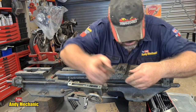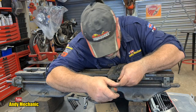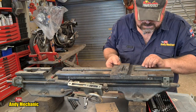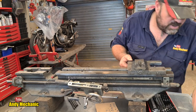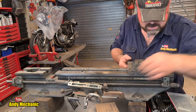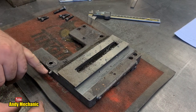All the locknuts are loose. Let's see if we can get these undone now. That's one, only got to back him off a little bit. Two, three, four. In theory that should now slide off with ease. Look at that! Very carefully on the bed - that is the adjustment sleeve kind of thing, that little piece that pushes against the side of the bed to take up the play. Holy moly - there's a lot of little bits on these things. We've got an oiling nipple - don't put grease in there whatever you do. We've got that little shroud at the front that usually holds a felt to stop all the swarf going in.